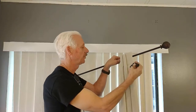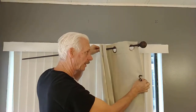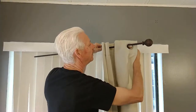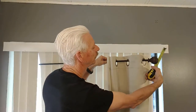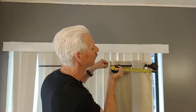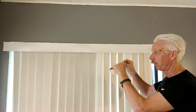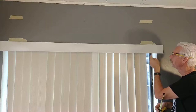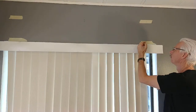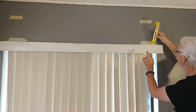Here's something to consider at the end of the curtain — you want the end of the curtain to go past the window a little bit, and you want the bracket to be hidden behind the curtain edge so nobody can see it. Four to four and a half inches works well. To avoid marking up your wall, put pieces of tape up there. I decided to go four and a quarter inches in from the edge, and mark on the tape — the same on both sides.